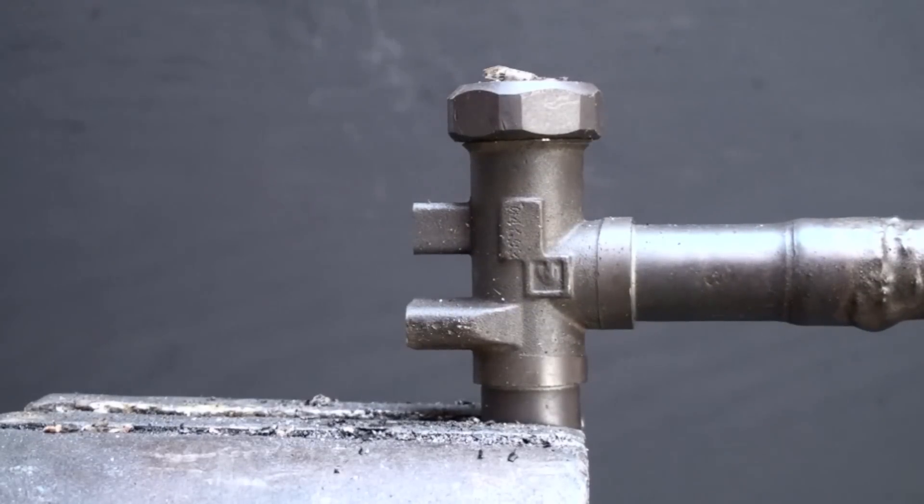I've been asked whether you can actually change the O-rings in the service valves on these split system air conditioners. There's an awful lot of problems with these valves leaking. Probably well over 60 to 70 percent of leaks in split system air conditioners are at the service valves. Usually it's because the valve has been overheated when the brazing was done, but I've been seeing quite a few of them fail that did not have an overheat problem — years down the road they'd start leaking.